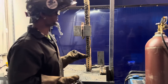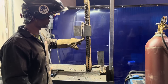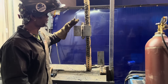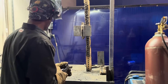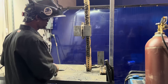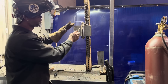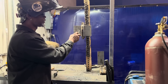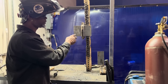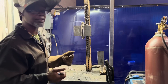As a rule of thumb, you can always come out on your run-off tabs — start on your run-off tab, end on your run-off tab. That way you don't have any errors or mess anything up. When they test this, the first inch is going to get cut out and not used. The next inch is what they'll use for your face bend, and then from the bottom they cut an inch and use that next inch for your root. So you have one face bend and one root bend.